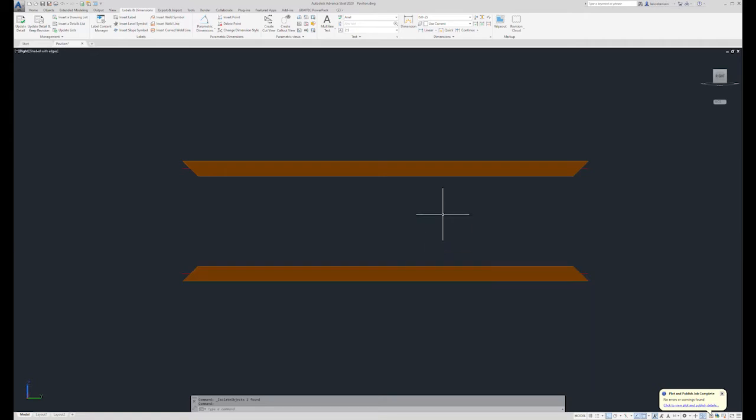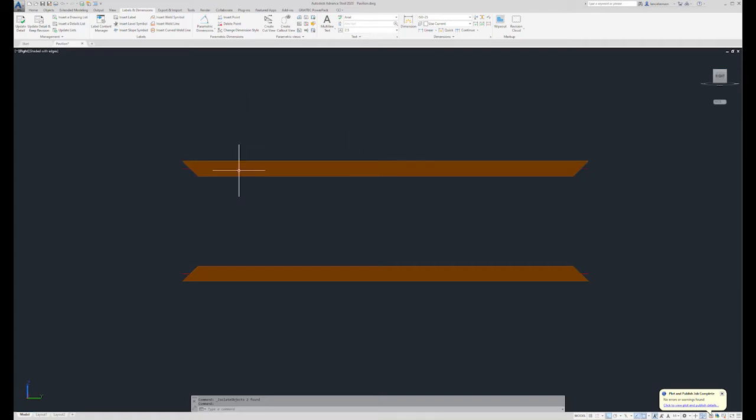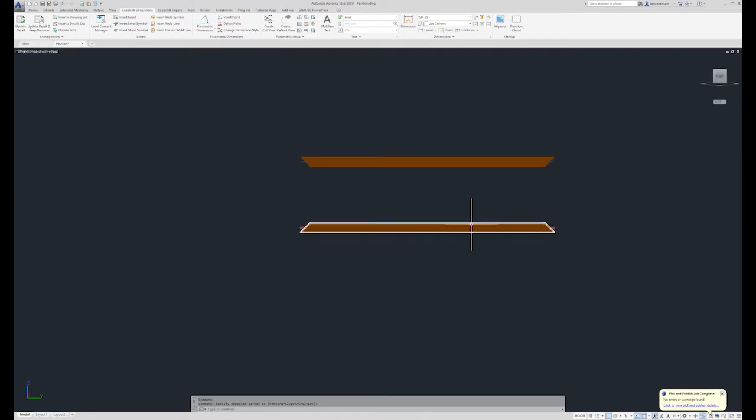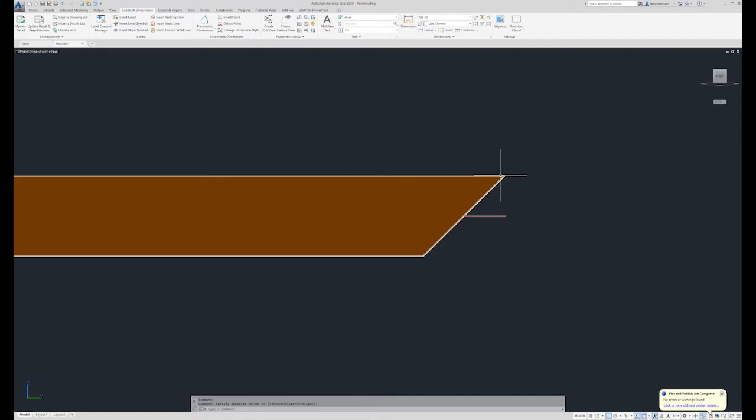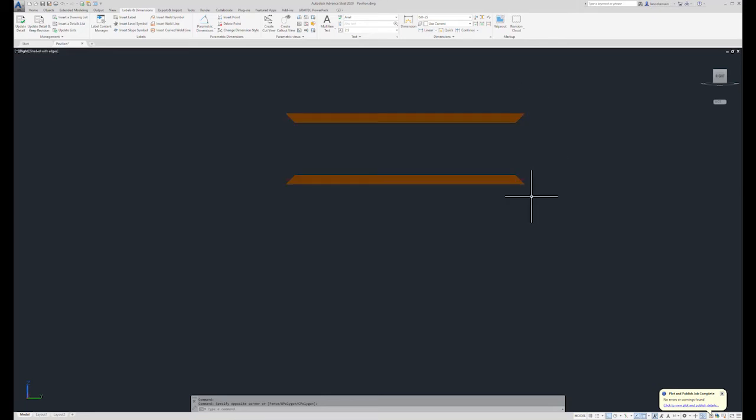So in our situation, I'd pick out my two primaries. I would clamp my first primary to my horses. We're talking about running horses under a third and a third of my parts, and I'd overhang each direction. Once this is clamped down, I'm going to measure with my tape measure from this tip to this tip, hanging my tape measure from here, reading to this tip. And I want to get my width set per my assembly drawing. I'm going to do that on both ends, back and forth until they're both exactly the same.